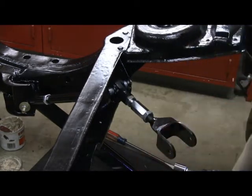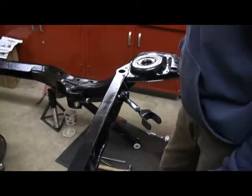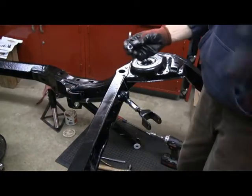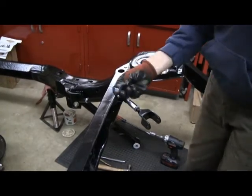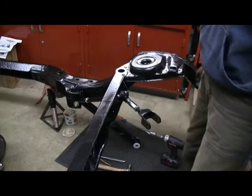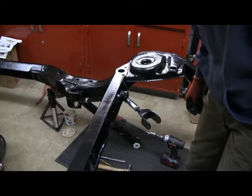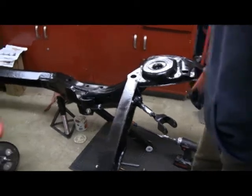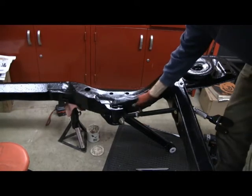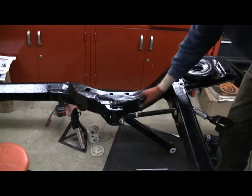One thing I'm doing is the kit comes with lock nuts, but I'm putting on just regular nuts right now. I'm not making them real tight — I want to get everything in place and then I will replace them with the lock nuts. The braces are adjustable, so I have everything turned right, and then I will jam it down and lock it off once everything's in place and I know everything works.